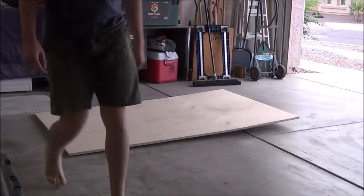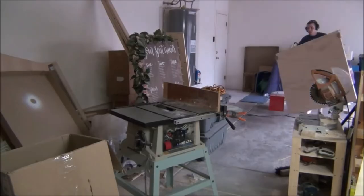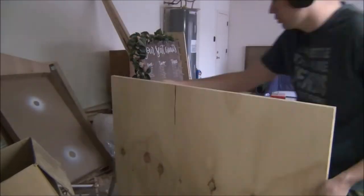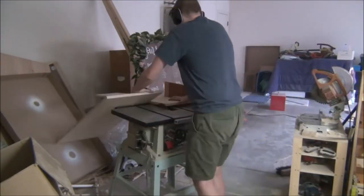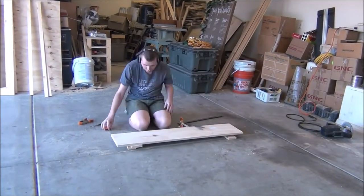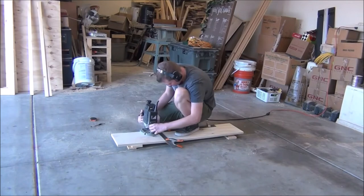Next up, it is shelf cutting time. I'm going to grab my sheet of 3/4-inch pine plywood - only about $30 at Home Depot - and get to cutting. We're going to cut out four 10-inch wide, 4-foot long shelves and one 10-inch wide, 3-foot long shelf. You're probably going to start piecing together what we're going for now, but please act surprised - I need the encouragement. We're then going to take one of our 4-foot long shelves and cut a channel through the top of it about a foot from one of the sides, just like we did previously for the rectangular frames.